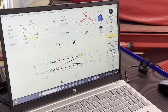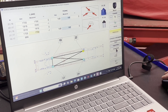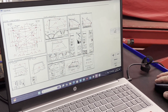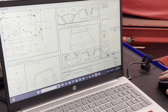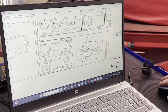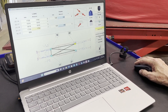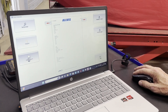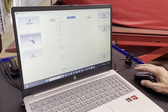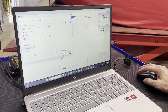Now we have measured, recorded, and saved our reports. We also have the old school type charts — if you need those, they are available. The program has upper body numbers, under hood numbers, door openings, windows — every number that you'll need to make a repair on this vehicle. Once all your numbers have been registered in the computer, you go to save this chart, go to print, save report, and verify your save. Now your report is saved. That will be your before, and you'll have the same thing in the after repair column once we're through.